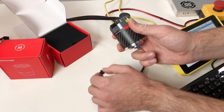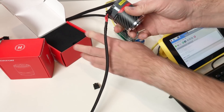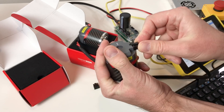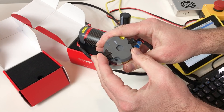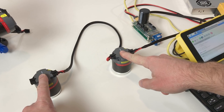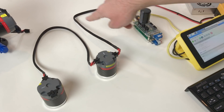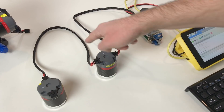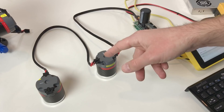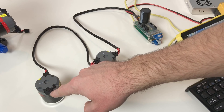If you're going to use only one actuator you need to put a termination resistor here. If you want to use two of them you need to connect the second actuator here. So we're going to use two actuators at the same time. This cable goes here, and the termination resistor goes here. I'll position the actuators so you can see the LEDs. From the electronic board the cable goes to the first actuator, from there to the second one, and at the end I have the termination block. If I had 10 actuators I would connect them in series and put the termination block at the last one.